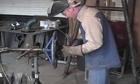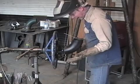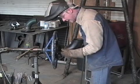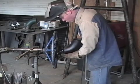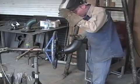According to my gap on both sides, I'm pretty symmetrical. There's really no way to square this off the flange — you could run a square and do some configuration, but it's not necessary because these are machine edges, factory edges that are true. They've been laid in a perfect setting so they're square. If my gap is the same on both sides, I'm okay. I'm going to go ahead and put my other two tacks in and secure the piece.